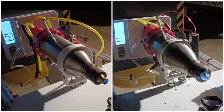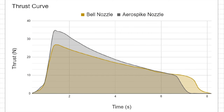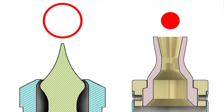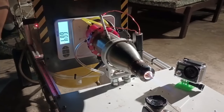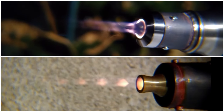How did this nozzle perform? From initial observations, it appeared to have 29% more peak thrust, but it also ran out of propellant a little bit faster. This is quite interesting because with the same throat area, they should have had roughly the same rate of propellant consumption. The difference is likely due to the aerospike having a higher coefficient of discharge over its annular throat as opposed to the original circular throat. The hot gas tests were performance-wise much better than the cold gas tests in terms of both thrust output and efficiency, and this high peak thrust is very promising because the firing duration wasn't that much shorter than with the bell nozzle.